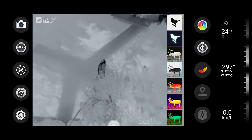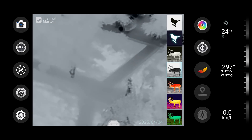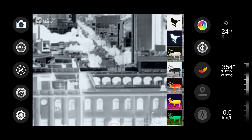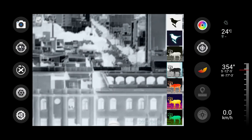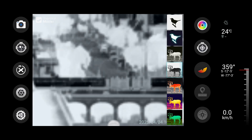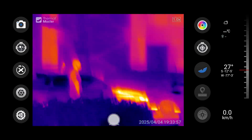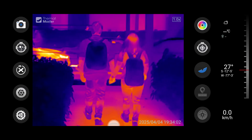When you see people walking, you can see the vegetation and the high thermal contrast, which is also thanks to the 20mK sensitivity. That's huge, especially for an uncooled sensor. You can see the traffic very clearly, and this point is 350m away. Even with a high zoom level it remains very nicely readable and it's very far away. For a 256x192 sensor this is incredible. Here are a few more clips in different environments — I'll let you enjoy this without any further commentary. Any questions, you can let me know in the comment section or send me a message on my Discord.